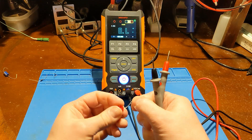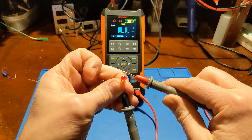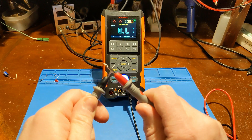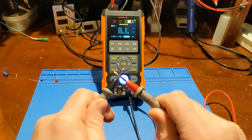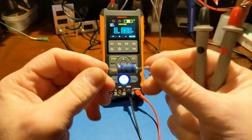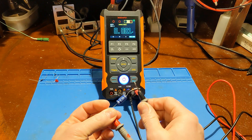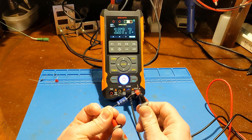Is there enough voltage to light up an LED on diode check mode? I think the polarity is right — yes there is. The voltage is high enough to check LEDs, which is a nice feature. Next is continuity — it's pretty quick, works fine, does continuity things. Next, capacitor. I think it's a 100 microfarad capacitor. Giving it the right polarity — and there it is, 107 microfarads.